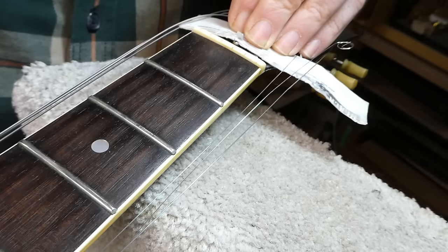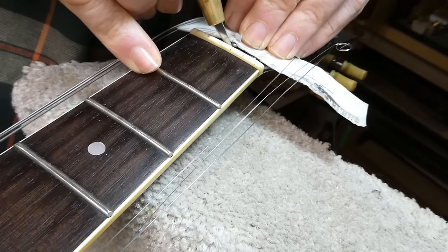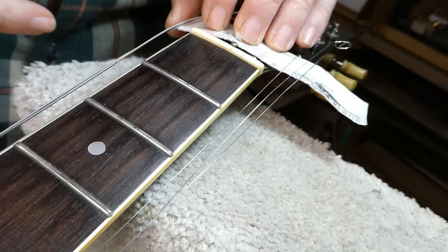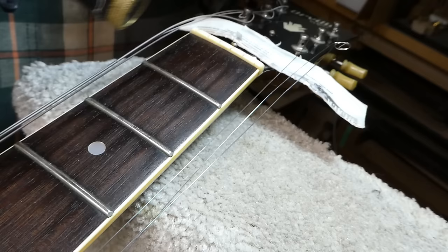We'll see how well this thing is glued in. There's a bit of a gap along the back edge. I run my knife in there, and there is actually quite a lot of glue in there — there's no excuse for that. There's no need to glue both sides of a nut into the guitar. You can put some on the underside if you must, but I usually limit mine to the front face of the nut. Because when I go and hammer this off, it's not going to do any damage to the end grain surface of the fingerboard.